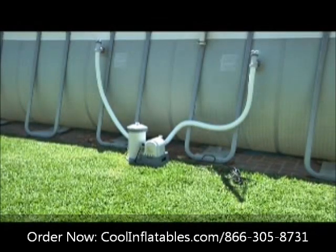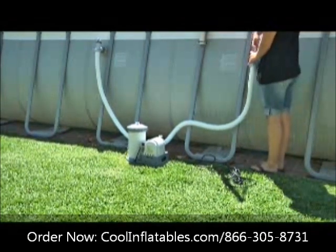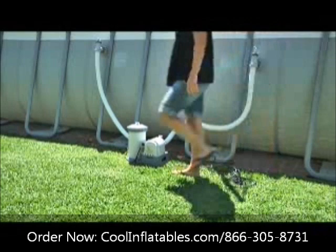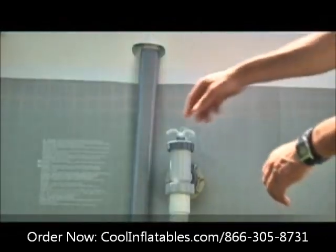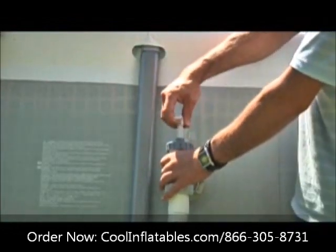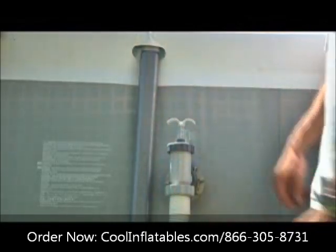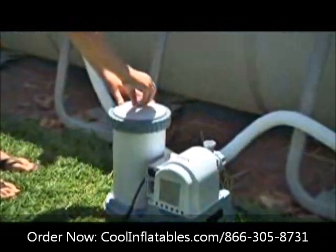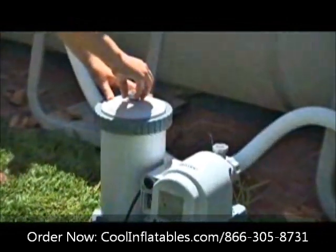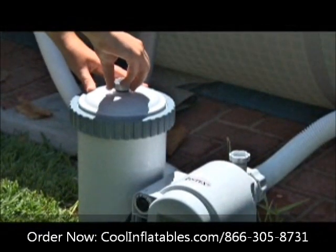When the pool is filled, water can be let into the pump before it is turned on. To prevent airlock, open the lower plunger valve first and then the upper valve. To open the valves, turn the handles counterclockwise and pull up until they stop, then turn them clockwise to lock them at the open position. Finally, open the air release valve on the filter tower to allow the trapped air to escape. When water flows out, gently tighten the air release valve with your fingers.